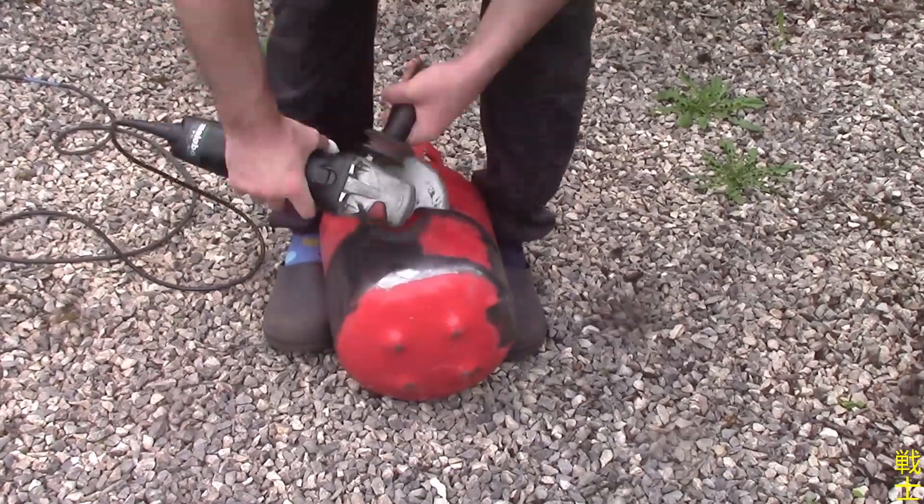I just have to remove the remaining paint, as there was no need to weld in that area and I cut away most of it anyway. With that out of the way, the structure is done and I can start with the insulation, for which I use a ceramic fiber mat. They are delivered in big mats and must be handled with care. Always wear a respirator when working with the material and make sure to clean off the fibers as soon as possible after finishing. I fit the mat as one continuous roll to the inside of the tank and cut a hole for the burner to fit through. Basically the forge would be ready for use now, but the ceramic fiber material would start spouting fibers into the air any time the forge is used, so it must be covered.